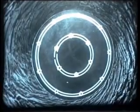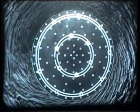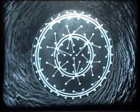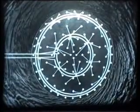But you can't take risks with a mains supply at any time, and as we shall show, the system is elaborately safeguarded. First, the sets of primers are unpacked at shaft bottom and distributed to their appropriate rings. The 4 connections are made between the ends of the buzz wires and the conducting cable.